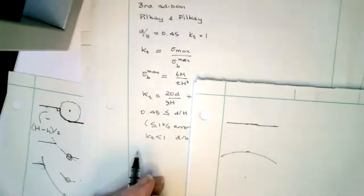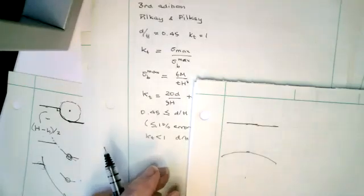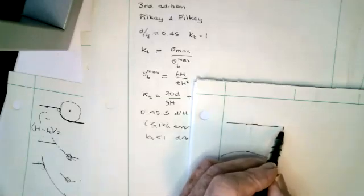Yes. Typically, I picked the chassis. That's a good question. I picked the chassis of a vehicle. That's nearly all bending. Okay. There's very little tension. But you're right. If there was a lot of tension as well, then no. You go back to that. I forget what figure it is, but it's in the book. Where you have a hole under tension and you start having sizable d upon h, then you would get big stresses out there. And the only reason the stress concentration factors were less than 3 there is because we used the nominal average net section stress, which I discussed at the beginning of class today. But that's getting big. If you started removing, here I'm going to remove 3/4 of it, and then the average stress here would be 4 times bigger than it is out here. Okay, so. But this stress concentration factor looks like this.